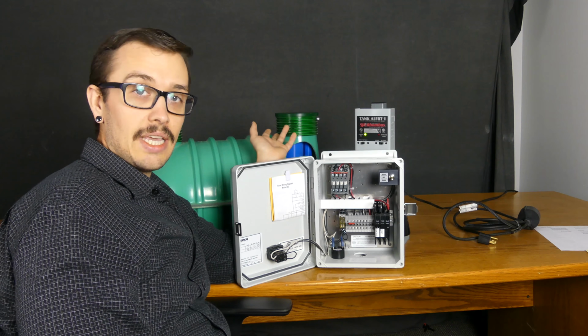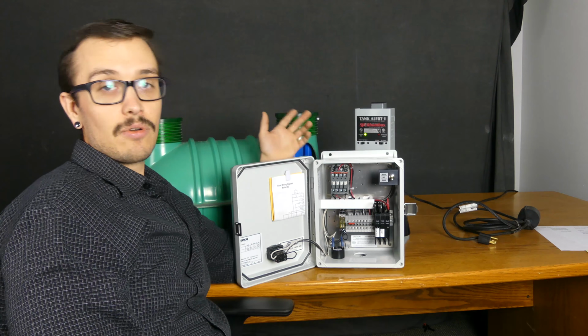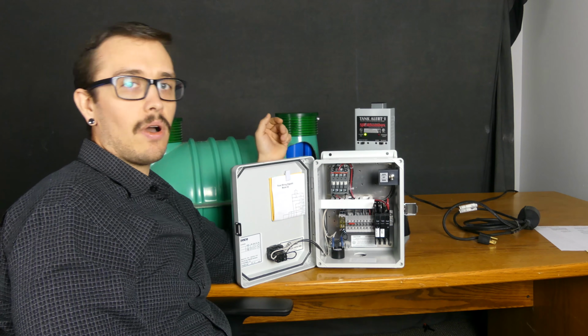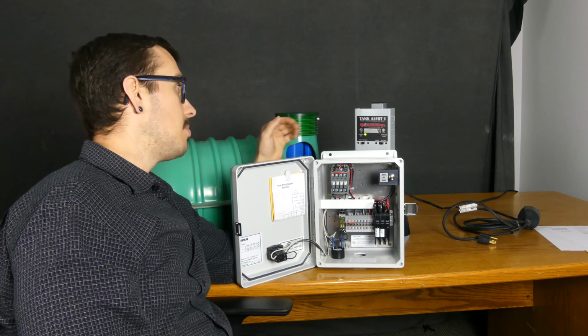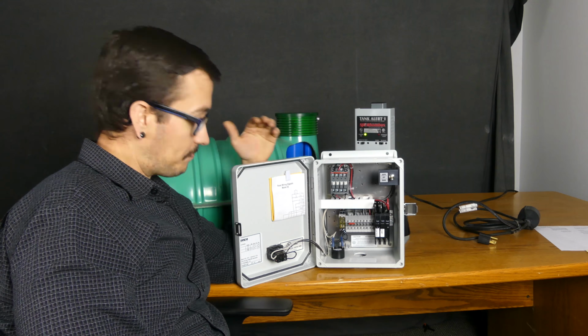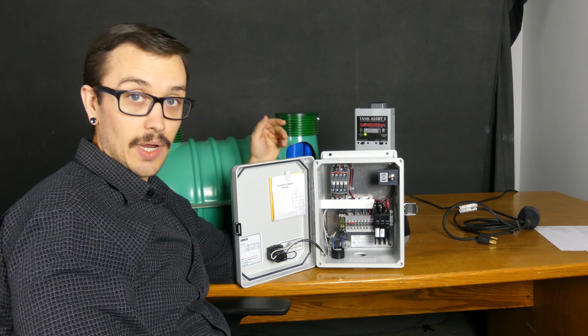Had you opened the lid and the liquid level in your tank was low or at its normal level, you would know, well, maybe I just got a bad alarm float. Maybe it got waterlogged or something along those lines. But if the water was high, you would know that it's probably more likely the pump switch. So to test a switch is actually quite easy, and I can just show you real quick.